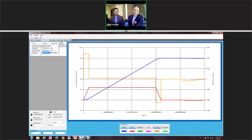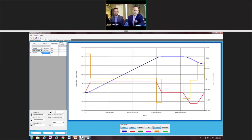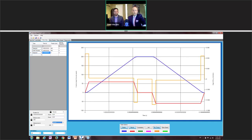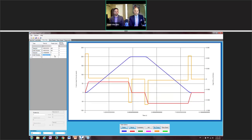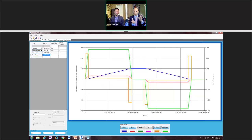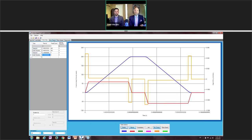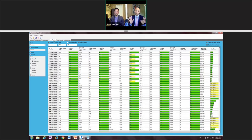Let's add a one-second dwell, then follow it up with a reverse move — this really comes in handy for vertical applications because it accounts for gravity and any regeneration needed on the application. Add another dwell for good measure to make the profile complete. You can click on the tabs to make the chart bigger and focus on just the velocity profile by removing position if desired.